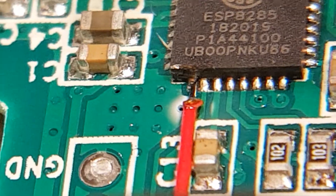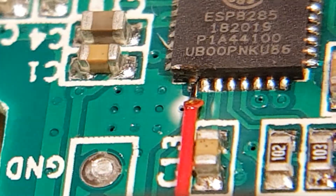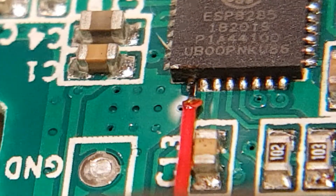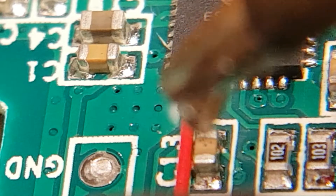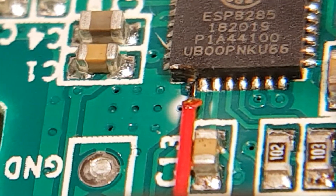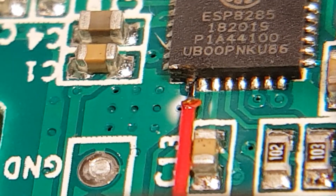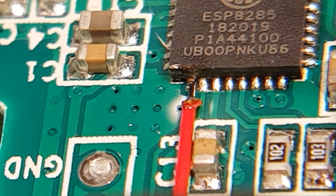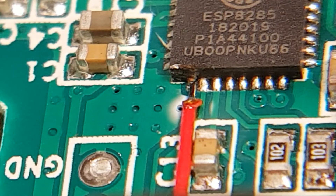Here's the size of my soldering iron - it's two millimeters across, so it's a giant soldering tip. I'm using wire wrapping wire to connect it, so I pre-tinned that wire wrapping wire and laid it in place using some helping hands to hold it.